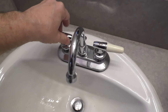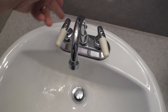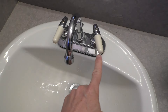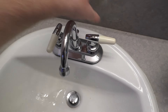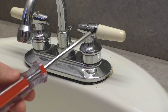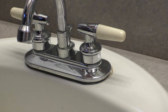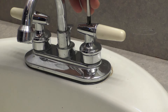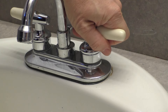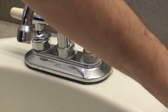I went ahead and turned off both the hot and cold water. Even if you think you know which side it's leaking from, you want to turn off both, because you could actually get water circulating back — so you need to turn off both hot and cold to stop the water. Next, take a screwdriver — typically a Phillips, but it might be a flat head — and look for a screw on top of the handle and remove it. Wiggle the handle off; it may be easy or it might be hard.